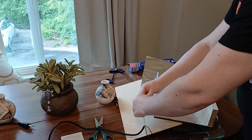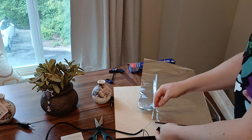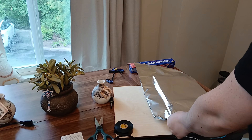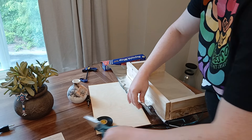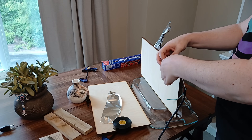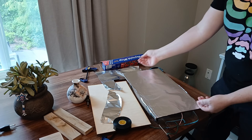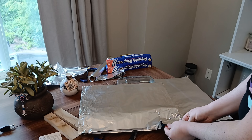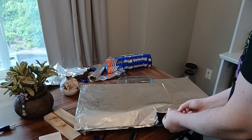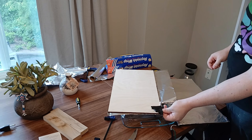The concern here is that as a conductor resists electricity, it generates heat. As metal heats up, it resists electricity even more, which generates more heat, and so on until you have an electrical fire — we don't want that! So we roll out aluminum foil onto the plywood and go totally overkill splicing it to the wire. While I used the National Electrical Code to make sure my math was in the right ballpark, this device violates the NEC in more ways than I can count. Leave a comment with your favorite way this device violates your local fire code.